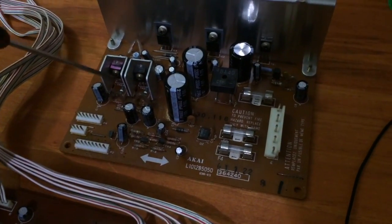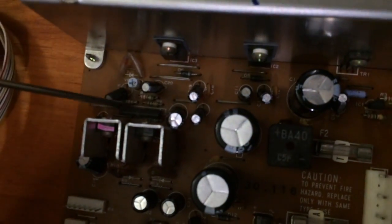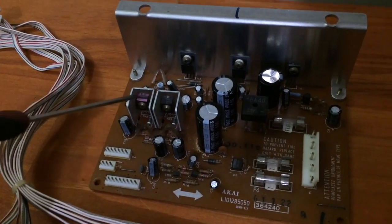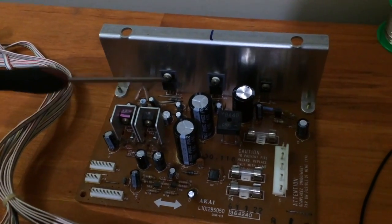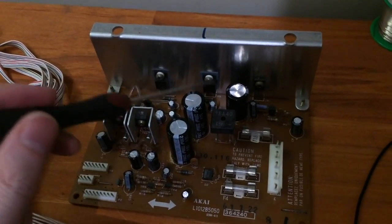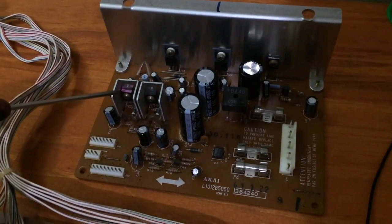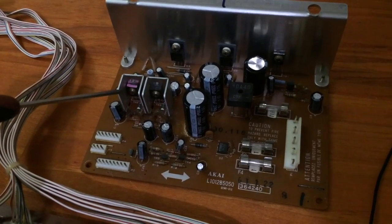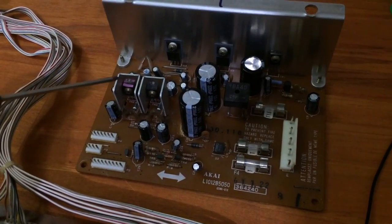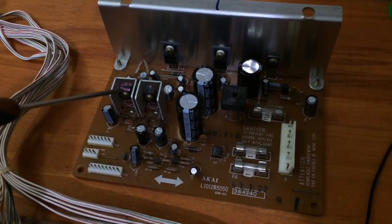And they're switched on and off by a little IC that's sitting behind them. But it's the two transistors that do all the work. And they have quite a large voltage drop across them because they're being fed from these plus minus 15 volt regulators, and they're only outputting 6 to 6.3 volts. So there is a lot of heat that's going to come off them.